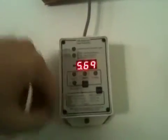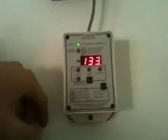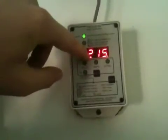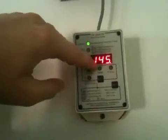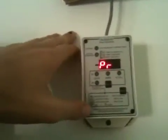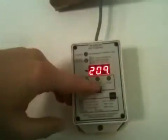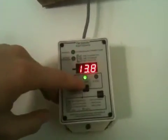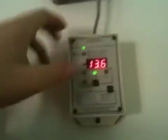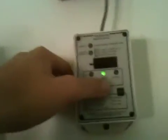In the secondary settings — accessed by holding down the select button — it will show you watts instead of amps. Right now we're putting in close to 200 watts into the battery. You can switch it so it displays watts instead of amps, and then switch back again. Once you go back to the secondary settings by holding down the button again, it will read amps instead.